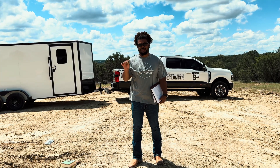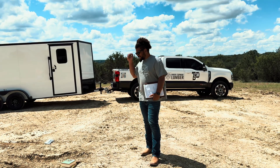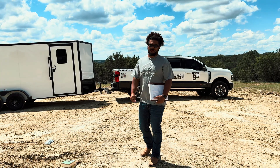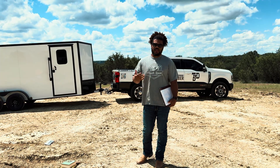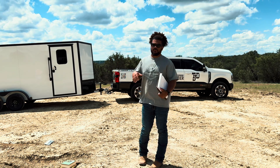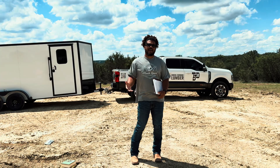My daughters have made pots out of the clay on this very spot. That is not good soil for slab foundations. This means we have to scrape it. We can choose to bring in select fill, or we can bring in a company that will do injections — they shoot rods into the ground and inject chemicals like lime — that stabilizes your soil so it doesn't have shifts.